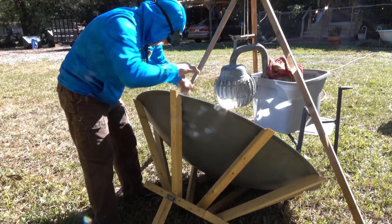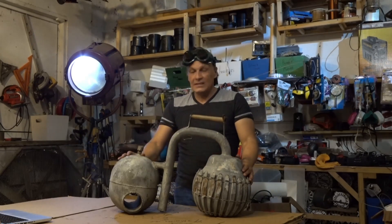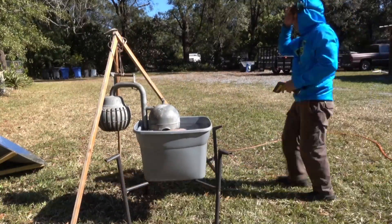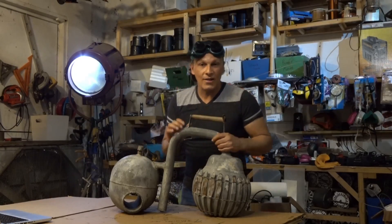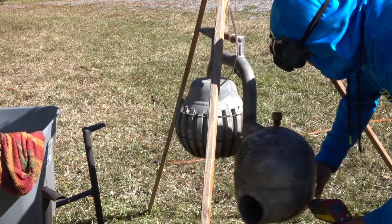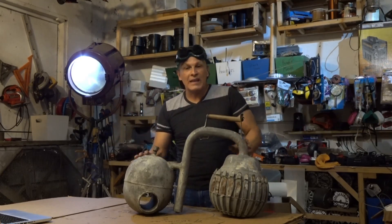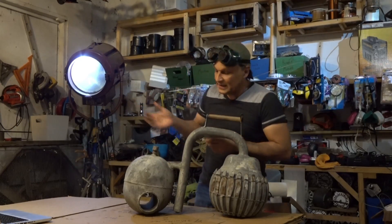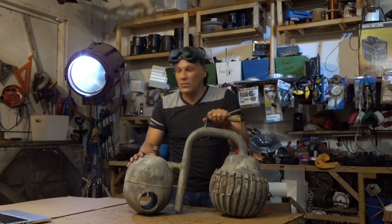With our test, I focused the parabolic mirror on this side for 20 minutes while this side was in the cool bath. Then I flipped it around, put this side in the cool bath, and it actually dropped down to 57 degrees Fahrenheit — about a 25-degree temperature drop. It stayed cold for roughly one hour to one hour and 20 minutes. I didn't have it in a freezer, just sitting outside in the sun, but it actually worked like it was supposed to.